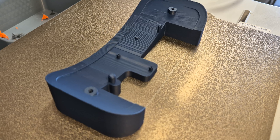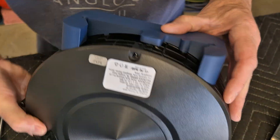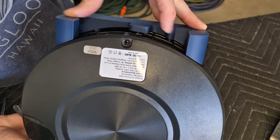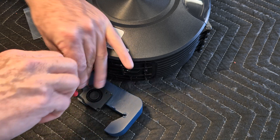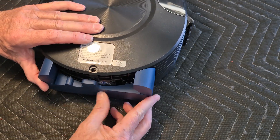After taking measurements, I would produce a cutaway version of the model for the area that interfaced with the dryer. I would test it for fit and make adjustments to the CAD model until the fit was good. I tested the fitment of the fan screws and adjusted the holes until it was just right. There were approximately four test prints that I made before printing the final model.